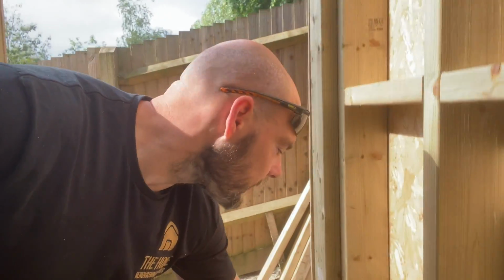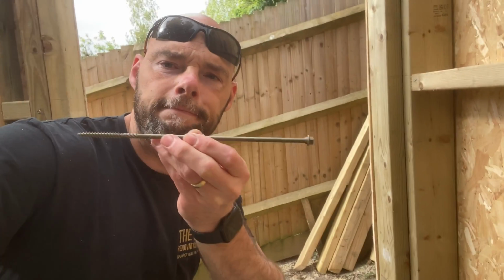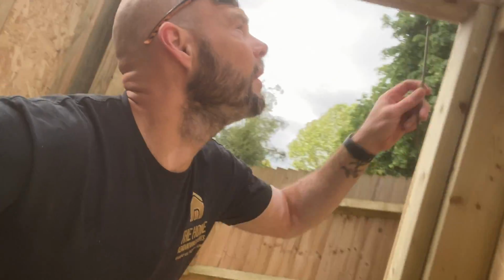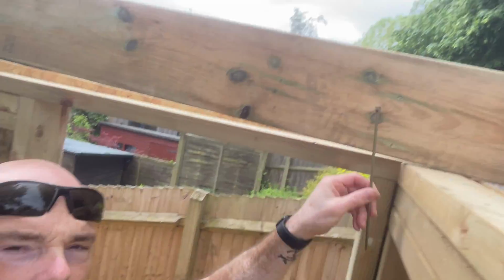And there's something else that I do as well, which is obviously I do put joist hangers on them. Another thing I also do as well, again, just bolts and braces, I use these lovely ones for the corners, if you watch the first one, these bad boys. So these are like 250mm, so I literally put that straight through the top, all the way through, boom, straight into that timber. So with joist hangers nailed in, and this, I'm confident whenever we get a storm, I'm not lying in bed going, oh, I hope that roof stays on. So I know it's bolts and bracing, it's OTT, but it doesn't take long to do, right? And it just means it's happy days, it's never going to come away.